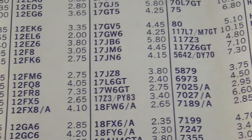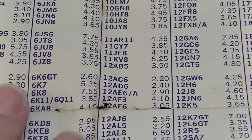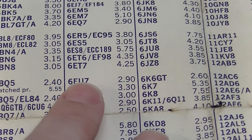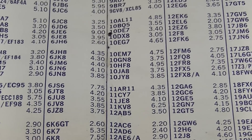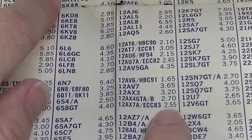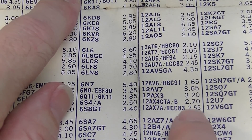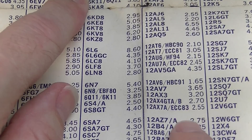They also used the 6EU7 quite a bit — that's $2.90. Around 1965 is when they did phase out the 6EU7; they used it through the early 60s and it was quite prevalent in Gibson amplifiers for the preamp. But a 12AX7 was a few cents cheaper at $2.55 as compared to $2.90 — so it's just economics. Plus the 12AX7 is a more versatile tube because you can wire it in either 6 or 12 volt configurations.